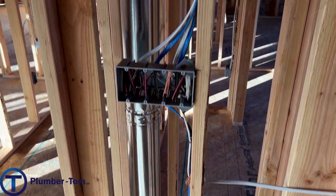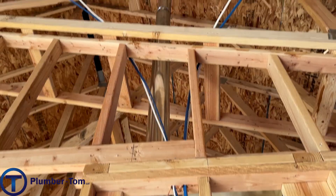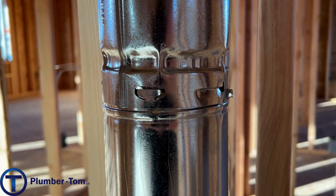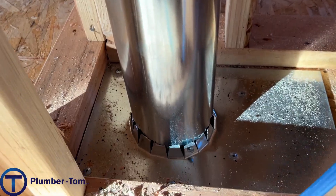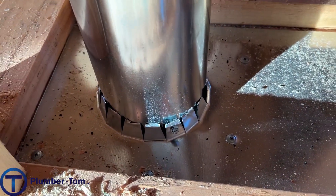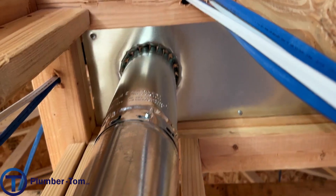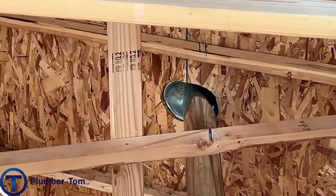This is ideal for a water heater flue — it's coming from the basement with a straight shot all the way out the roof. The flue is double-wall Type B, so it can be closer to combustibles, but they've also removed all of the combustible wood structure around it so there won't be any risk of burning up. You can see it going out the roof with the structure cleared out.